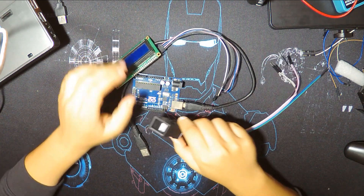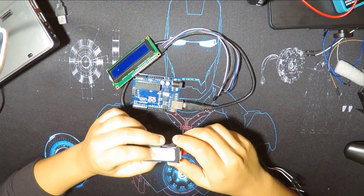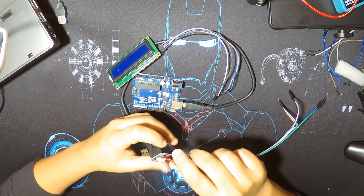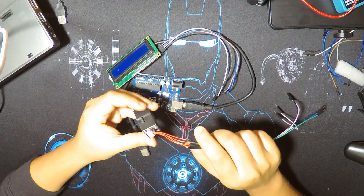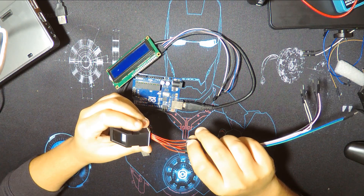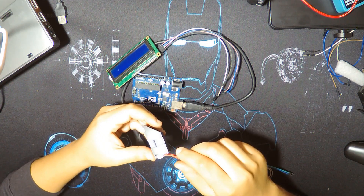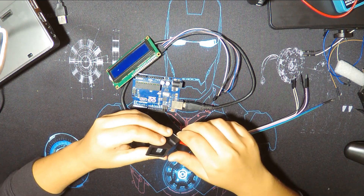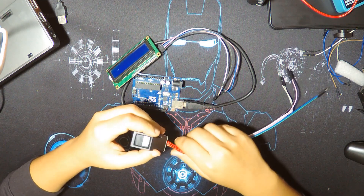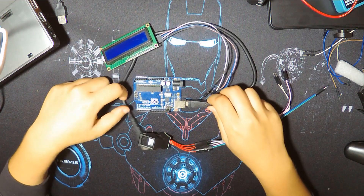This module name is FPM10A or 50DY as written here — there are many versions, so this is one of the classic ones. It has six pins but we're going to use only four: ground and VCC, then RX and TX. As I said, it has an internal flash where it stores the fingerprint templates and compares them. The Arduino is just for the communication.